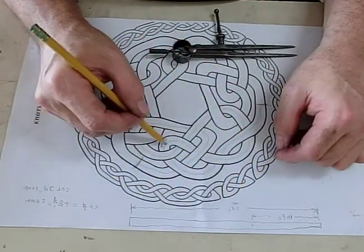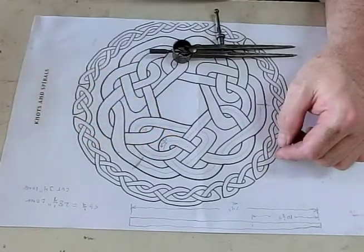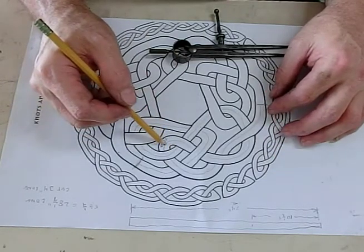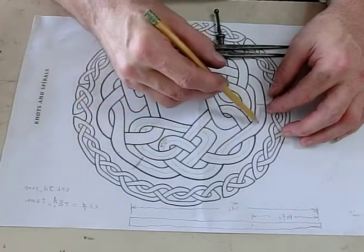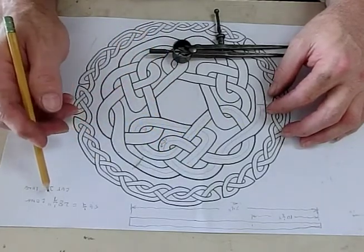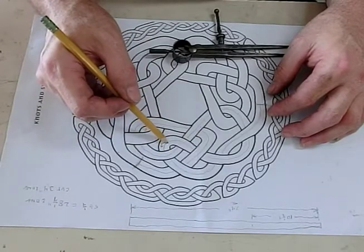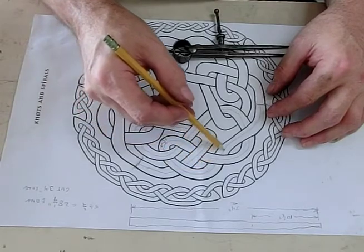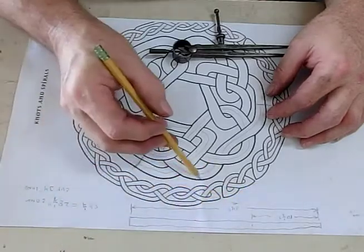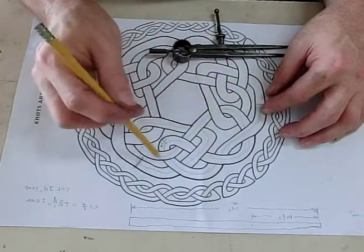We're going to make the first bend here because this is going to be the hardest bend to make. It's a full 180 degrees. And we're going to start the bending there for the pattern. If you just started at the end of this thing and started bending and trying to overlap this, it'd be awfully difficult to do and come out sort of right. So we're going to make the first bend here, and then we're going to try to bend this bend underneath. So this thing would be going off straight like this piece at that point. We'll be bending that underneath and trying to accomplish this bend. So we'd bend all the three pieces like that.